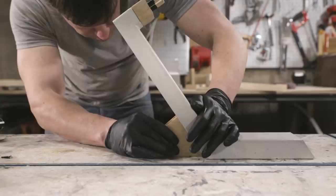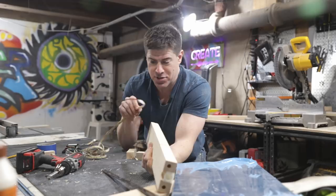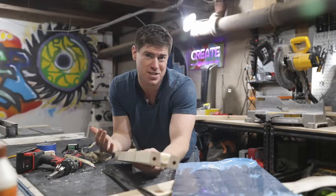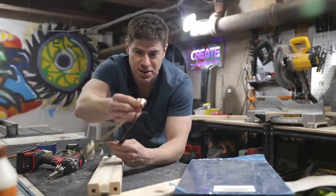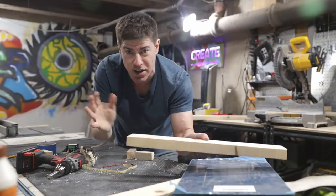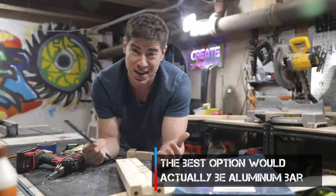When I started playing around with putting the LEDs into this circular PEX tube, I realized there were a couple of usability issues. It's really hard to get the LEDs to stick to the tube when it's already covered — there's really no way to do it. And if you just put them in loosely, they tend to twist and turn on themselves, which means not all the LEDs would point out and you'd get less light. So I decided to cut a thin strip of acrylic on the table saw — just what I had lying around — and stick the LEDs to it, then put that acrylic strip with the LEDs into the tube and get it oriented in the right direction. That also makes it really easy to pull the strip out if it ever needs to be replaced. Acrylic is probably overkill — any thin rigid material like quarter-inch plywood or Luan will work. I always find that the adhesive backing on LED strips gives out over time, so I used a little CA glue to attach the LED strip to the acrylic.